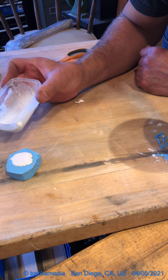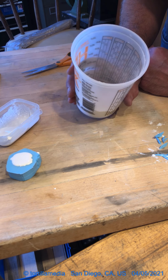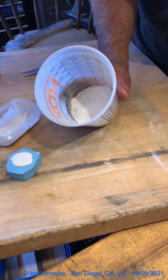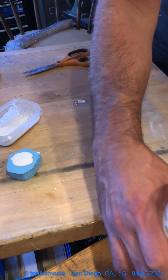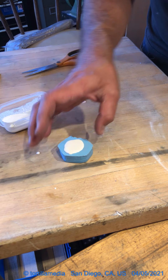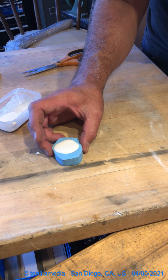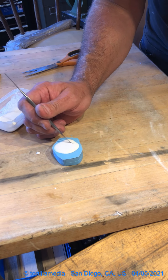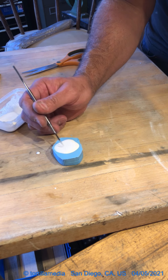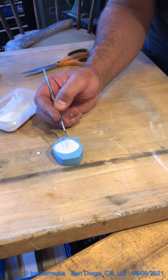You can see I probably mixed twice as much — it was really easy. This is hydrostone. You could also use hydrocal, which is also a gypsum-based plaster. Hydrocal and hydrostone in particular have a really high durometer — really super hard. Hydrostone is cool because it doesn't ordinarily absorb or get affected by water it doesn't need. It just uses the water it needs to harden, and then the rest will pool on top or get kicked out.